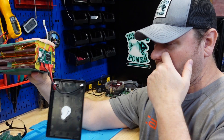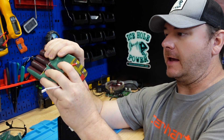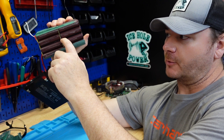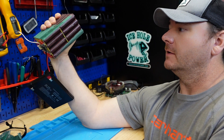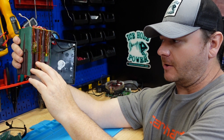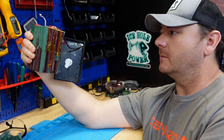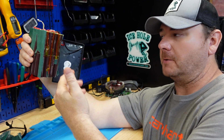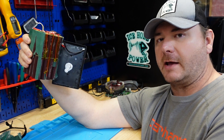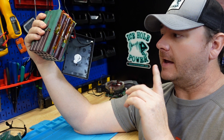Concluding thoughts: it's a very good build and it's priced right at $140 for 20 amp hours. I really like that they added the series cell separation to isolate the series cells — a great improvement. The balance leads are spread out and not crisscrossing, though I'd still like to see tape underneath them. It's not a perfect pack but it's a pretty damn good pack. Would have liked low temperature charging protection, but overall I recommend it. If you have any questions, let me know in the comments — thank you for watching.